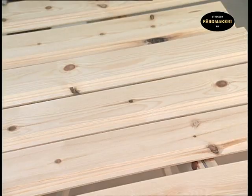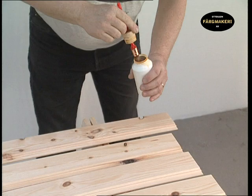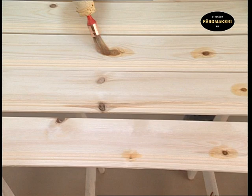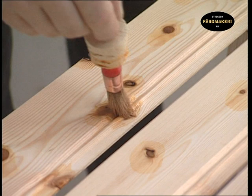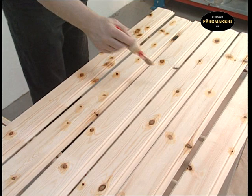We have chosen to apply three coats to achieve good coverage and a semi-gloss finish. Brush off any dust and loose material from the panels. Any planed wooden surface that is to be painted will first require some basic work. Any knots must be treated with shellac to prevent the resin from penetrating into the painted surface and discolouring it. The shellac can be poured into a practical shellac set to make the work easier. Then apply the shellac to all the knots. It is of no consequence if it comes outside the area. Repeat the treatment a second time after approximately 20 minutes.